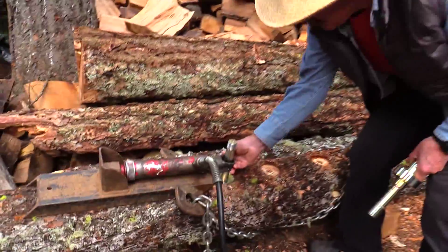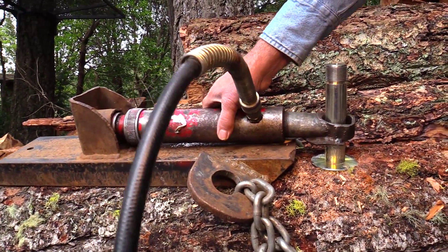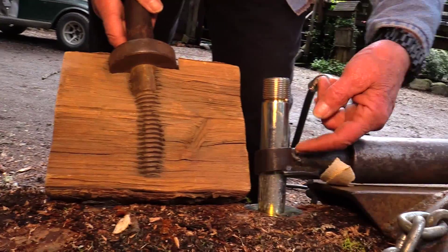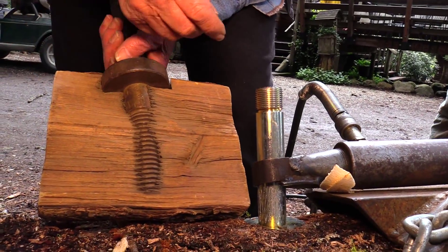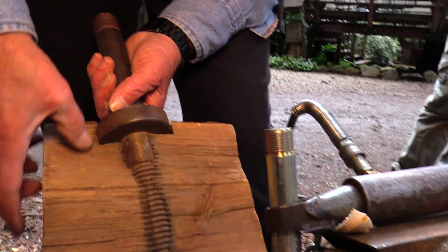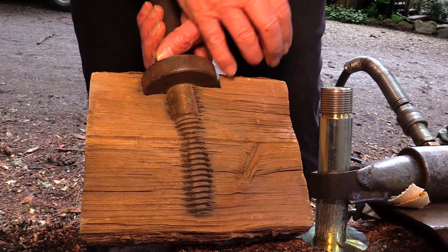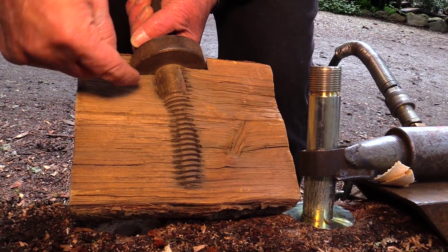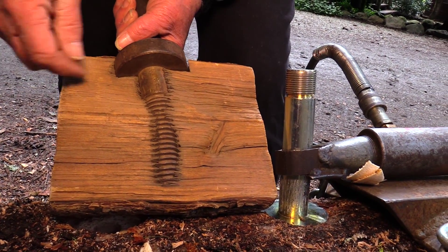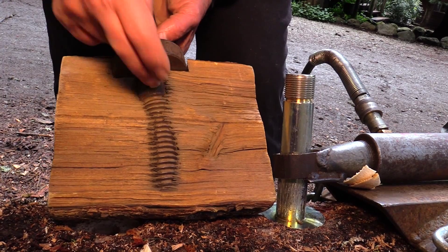We're going to test it here with this hydraulic jack. We're going to put it at two inches out and then apply a force. It took 10,000 pounds to bend this GL, and you can see where it compressed the wood here and here, which you would have suspected it would compress, and that caused it to failure and move away. But also, there's this whole flat surface of the boss, which also works as a bearing surface — and this whole area is what greatly increases the weight bearing capacity of a Garnier Limb.